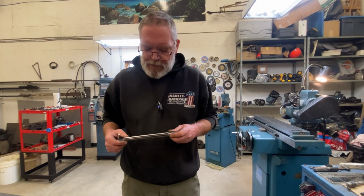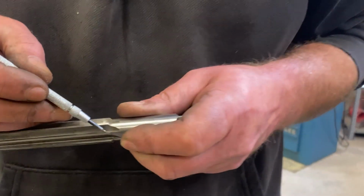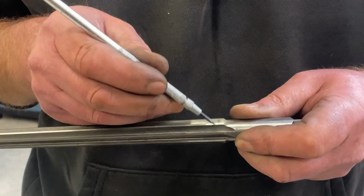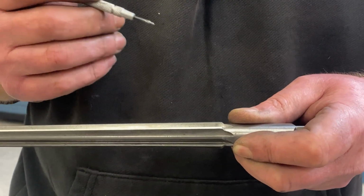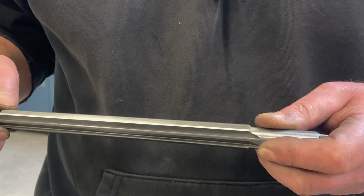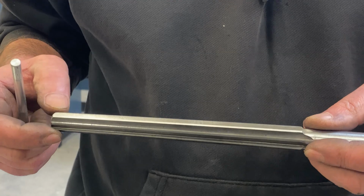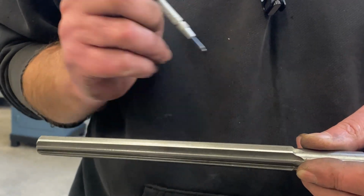Now this is going to be kind of tight because we actually have to take about 40 thou or 1 mil off of this end of the reamer in order to reduce it. And we're going to be running low-ish on flute. So now you do need a flute, of course, and when you reduce a flute, one thing is you have to watch your chip build up in there more carefully. So that might lead to more pecking as you're reaming, just to clear those chips out more often than you would have had to when the flute was this deep.